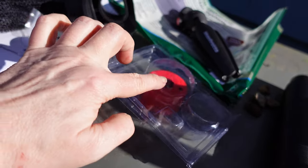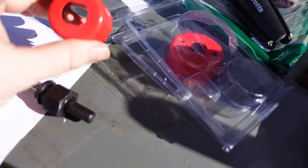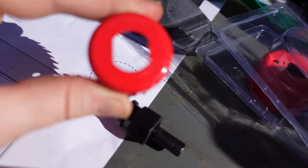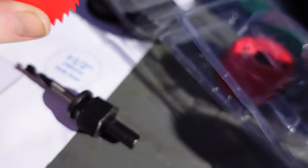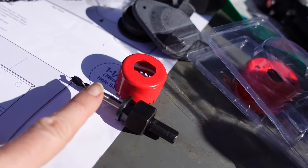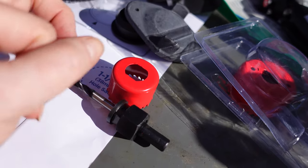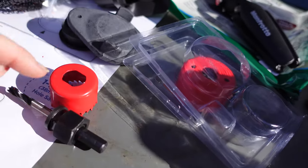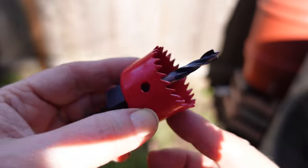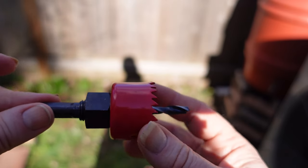This diverter kit has everything you need including the bit. There's a large bit to cut a hole in the downspout and then there's a small bit — this is 38mm, 1.5 inch — that's going to go into the side of the barrel for the inlet. You'll need to unscrew the nut, stick the bit into the hole, then reattach the nut and undo it to attach the other part of the bit for the different size holes. When the bit is put together correctly, it looks like this.